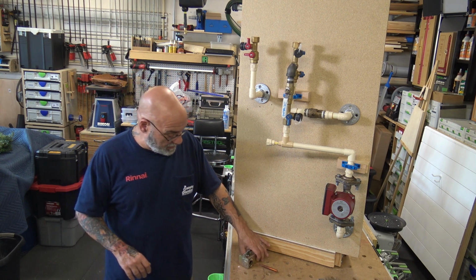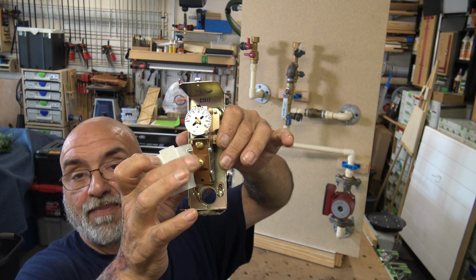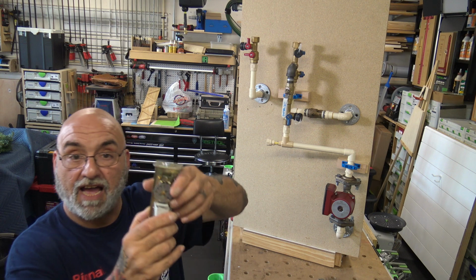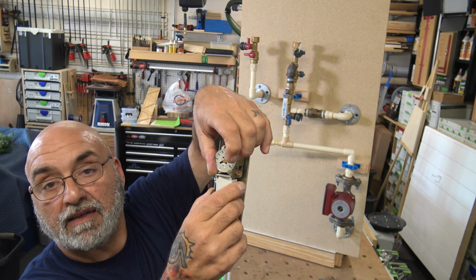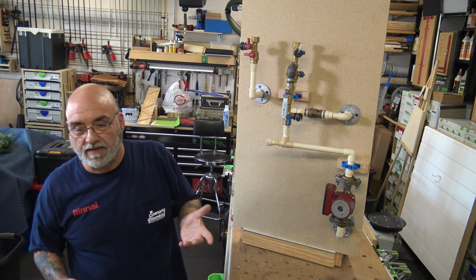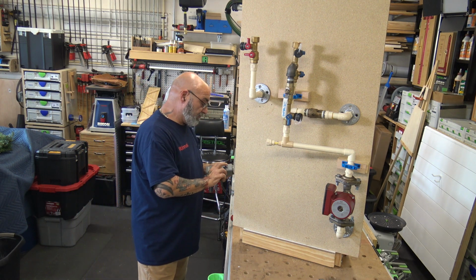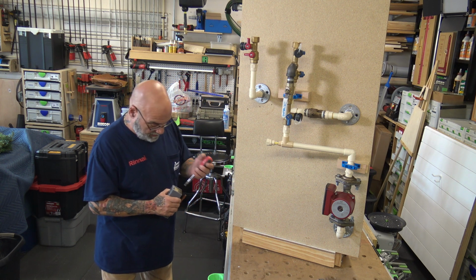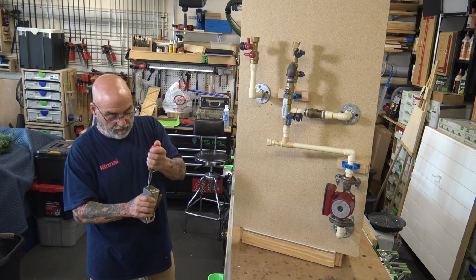So that is it, and then these are the 2 screws right there that the wires go on. The power goes on the top, and then going back to the pump goes on the bottom. And there's your dial. So it goes from 40 to 180. And I would set this at around 100 degrees, because your water's around, say, 120. I know a lot of your customers, they put it up higher. They want 140, but you know, it's all in their mind because the shower bodies are only giving, you know, 114, 115 degrees. And then you lock it down.